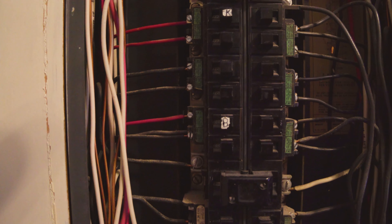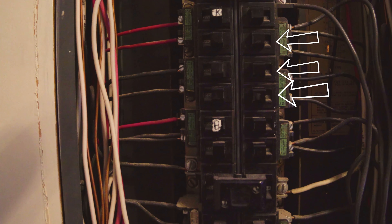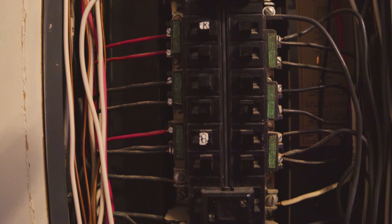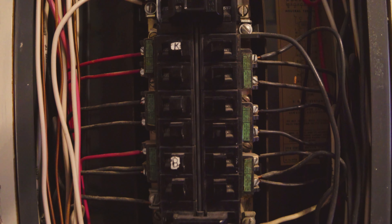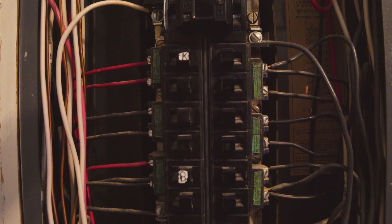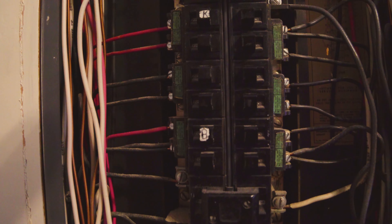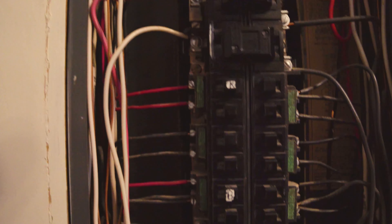Something that's not so great is that the indicators — those little tiny white things that turn black when the circuit is deactivated — sometimes turn black when the circuit is actually still activated. It does not indicate properly at times whether or not the circuit is active. Because they're really small, it's just not setting you up for an easy time keeping yourself safe.